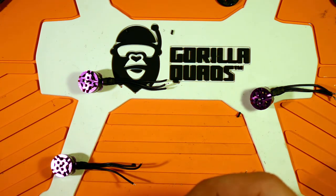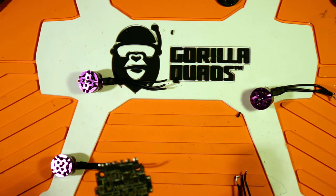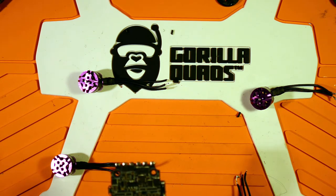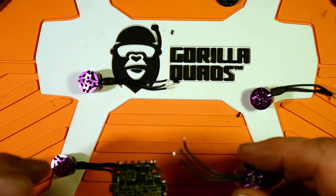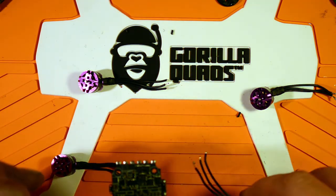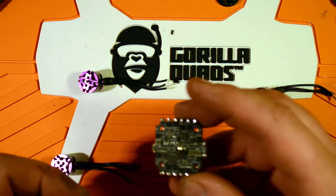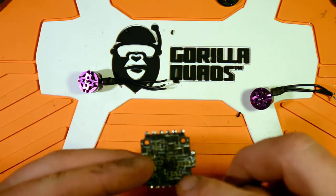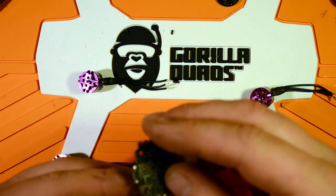Little helping hands are super helpful. Kind of like it's in the name. If you do get one of these, you just want to make sure you cover the little gator clips here with some heat shrink or something to protect whatever it is you're having a hold of there. So let's see, this board is going to go down like this. I'm going to start on this pad over here.